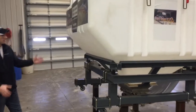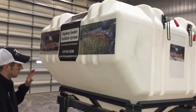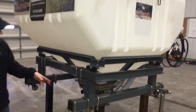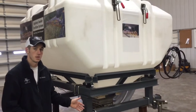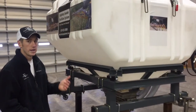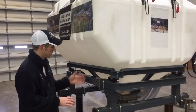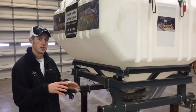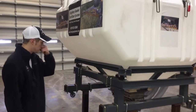You can see the frame and tank is designed specifically for highboys. This poly tank was molded to fit right in place of your wet tank. The four bolts that hold down your wet tank, your stainless steel tank, are the same ones that will hold down this system. It's actually a pretty simple switch — pull off the wet tank, undo your spraying lines, put quick couplers on those, and we'll drop this in and run our two and a half inch primaries and inch and a quarter secondaries out to all of our boom drops.